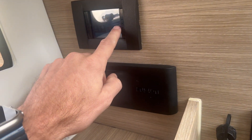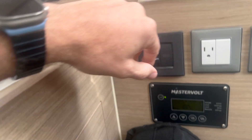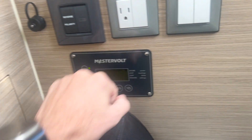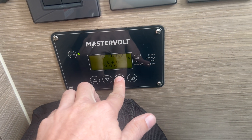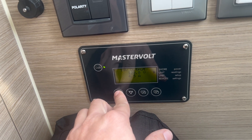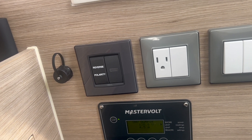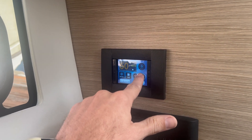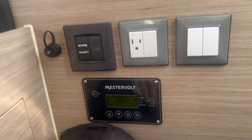Temperature on the boat is 62 degrees and I'm set for 60. Fan speed is set to auto. Looking at the master panel, the unit is drawing 4.5 amps, so it doesn't seem like it's at full speed. We're going to crank this up a bit more — I'm going to put in a big differential and go down to 50 degrees so there's really a big difference.